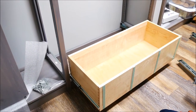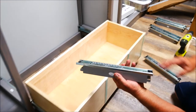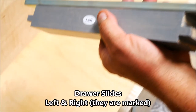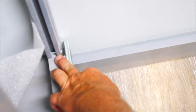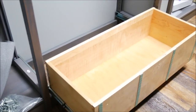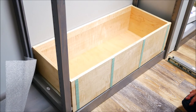Now, since we're starting from the bottom up, that's the procedure. You start with the drawer slides — they are marked left and right. Obviously, you want to keep the slide part forward; this is where the drawer mounts. You can see where the drawer slides into the mounts. Start by putting a pin on the bottom of the front, same level, and a pin on the bottom of the back. Then put a pin on top of the slides, because as the drawer comes out you want to make sure it doesn't lift up. So: two pins in the back — one top, one bottom — and one pin in the front. This is our deepest drawer. The front does not have the face on yet — you put that on afterwards.